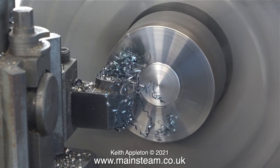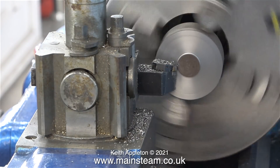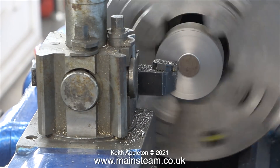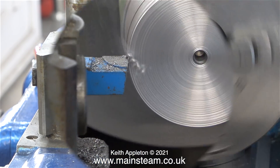As the tool is cutting, the swarf is coming off the piece of steel a nice blue color and occasionally red with sparks. This turning operation would benefit from using some soluble oil or coolant, but for the purposes of the demonstration it's okay. In this clip I've fitted a piece of cast iron into the chuck — this cuts like butter and does not need any coolant.